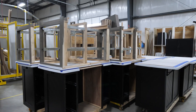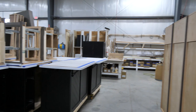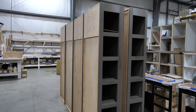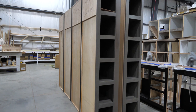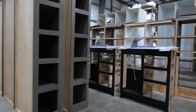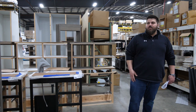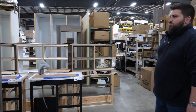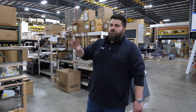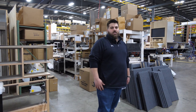Moving into our cabinet shop area — this whole corner of the plant is the cabinet shop. Things come in more or less mill length and our guys build all the framing, face frames, end panels, and islands. We use real Corian countertops. All your face frames are going to be stained or painted hardwood — it's not a paper-wrap product and it's not stapled together; it'll be pocket-screwed together like you'd expect in your house. When you hear about hardwood cabinets from competitors, the hardwood is just the door while the stiles where your hinges hold on are paper-wrapped — and nobody uses paper-wrapped lumber-core product at home because it doesn't stand up to day-to-day use.